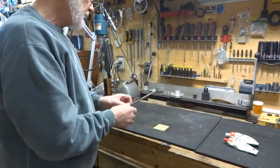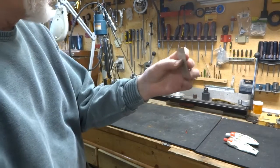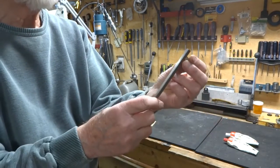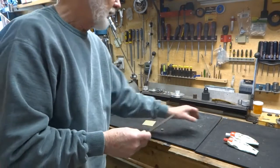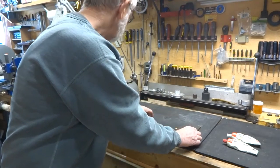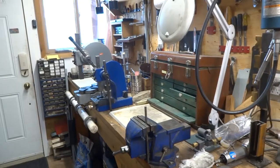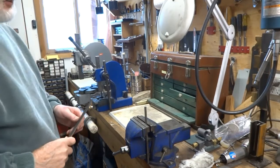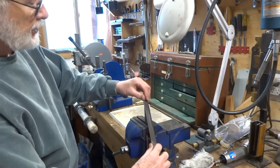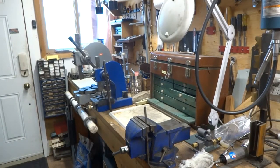For the clips, take a strip of sheet metal — about 30 to 40 thousandths of an inch thick — cut a strip off and make these clips. Just bend them like that and they fit over top; use a little epoxy glue and it'll be ready to go. A belt sander isn't absolutely necessary — all we'd be using it for is to round the edges so we don't have any sharp corners. You could do that with a file, using a rolling action on both sides, to smooth it off without the expense of a belt sander.